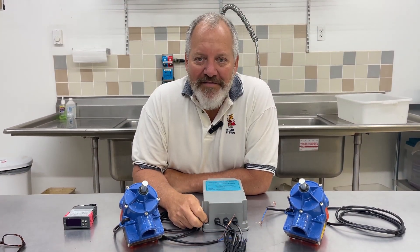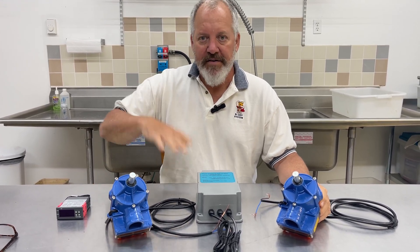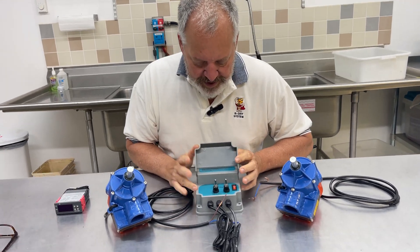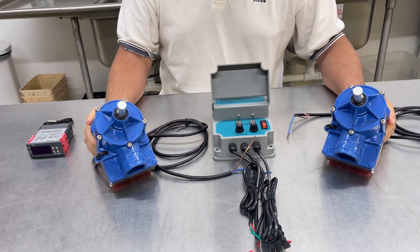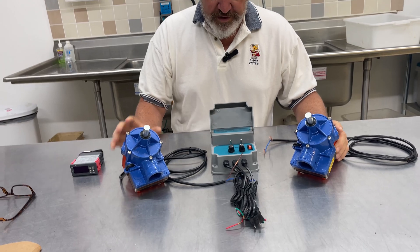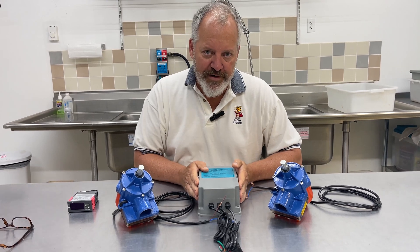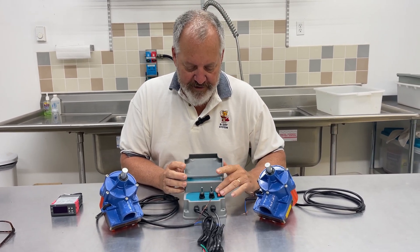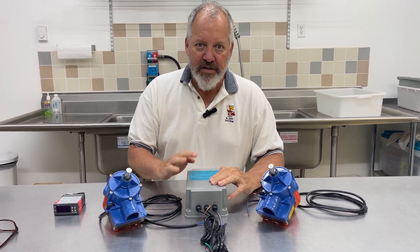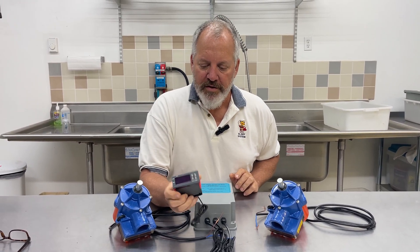My Amazon package arrived and I got my two high tunnel motors that are going to roll the sides of the high tunnel up and down. I also got a control box — it controls each motor with an on/off switch, and these are 24 volts. I opened the case up and there's a transformer in there; however, this transformer is not made to stay on all the time — it has an on/off switch. So I won't be able to use this for my idea of controlling these motors with a thermostat. So I bought a 24-volt thermostat.